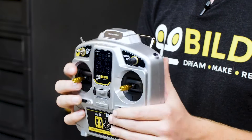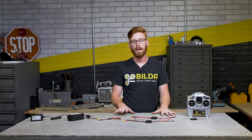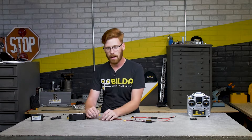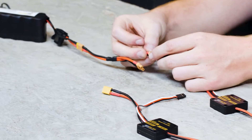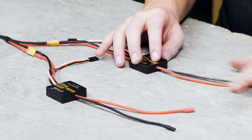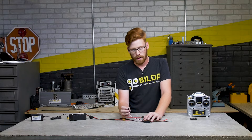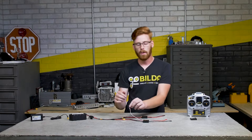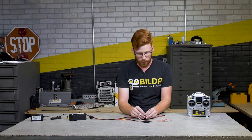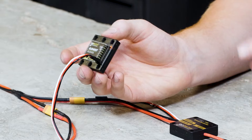These components all integrate together really well and create a very sweet plug-and-play system. Let's go through the process of making a couple of motors run along with a servo. First, we'll plug our battery into our XT30 splitter, then plug in both motor controllers. The motor controllers are getting 12 volts and will send up to 12 volts to our motors. They've got all three servo connector wires - and unlike a standard servo where the red wire carries power to the servo, this actually back-feeds 6 volts to power either your servos or your receiver, making it really easy to power your receiver.